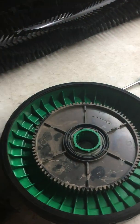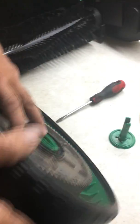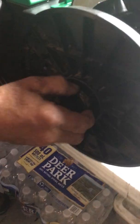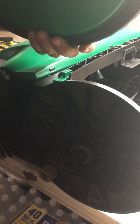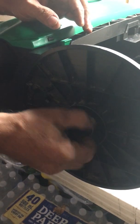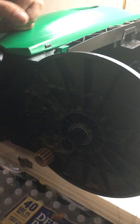On the manual units, you've got a gear inside each wheel. You've got two bearings — one outer bearing on the outside of the wheel, and one bearing on the inside of the wheel. This bearing here is seized up, so it will have to be replaced. Turn the bearings with your fingers — they should turn smooth and free. This one turns with no resistance. This one right here is dragging — you can feel it, and it's noisy when you turn it. So this bearing will have to be replaced.